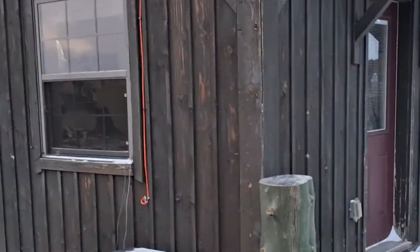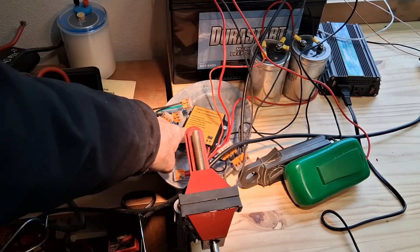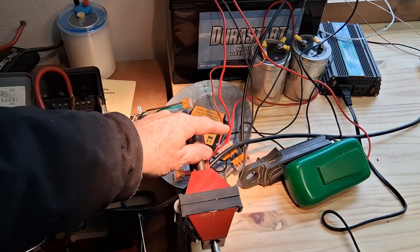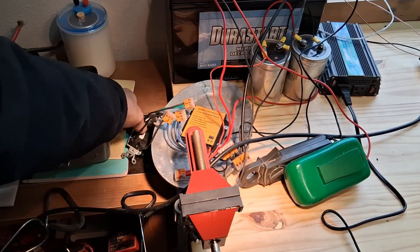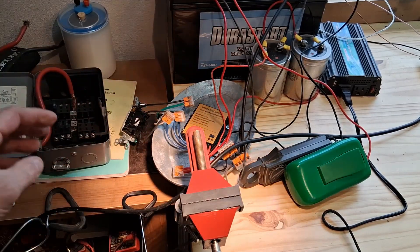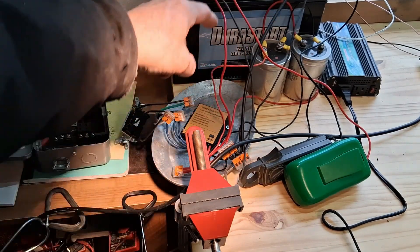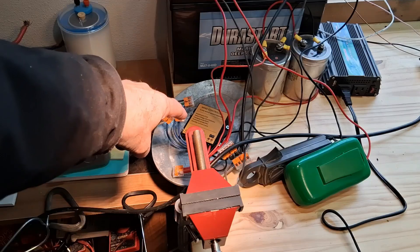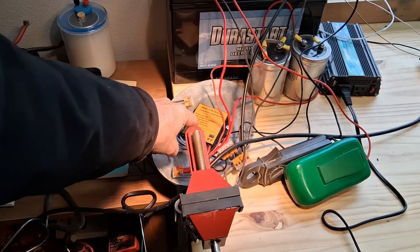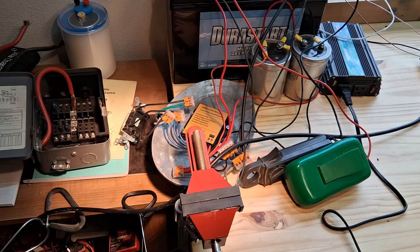I'll go inside now — freezing my hands off. This is the wind controller that came with the VIVOR wind turbine, and I added some other custom circuits so I can control it. This here is a cutoff switch that will just short out the windings on the wind turbine and bring it to a stop. I added some diodes and some capacitors so current won't flow back through the controller when it wasn't producing any power, because they say these will consume some of your power. I showed all this stuff in another video — I'll leave a link in the description for that.